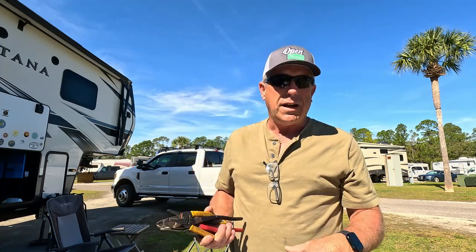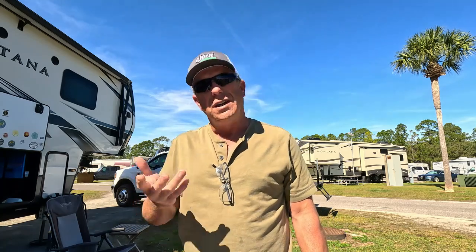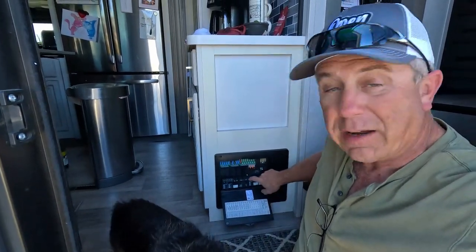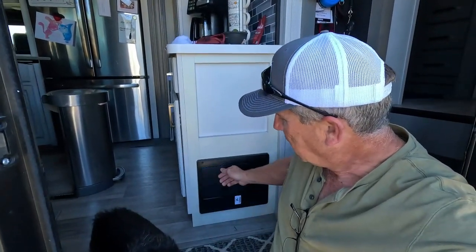The other thing you're going to want to do is make sure that you have got all power sources turned off. If you're like us and have a solar system, our camper really never knows that it's turned off. So you need to make a special effort to go to your breaker panel and turn off the breaker for the AC — you really don't want to get electrocuted while 13 or 14 feet up in the air. So go to your breaker box, look for your AC listings and flip those breakers off. I actually have three, so we're going to flip all of those off and make sure that they're off. Then we can climb on the roof and double check that there's no power up there, and we can get started on putting the soft start in between the start capacitor, run capacitor, and the compressor.